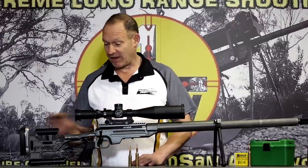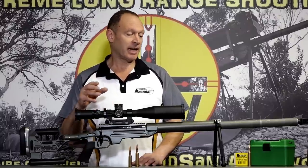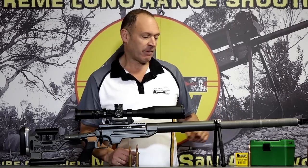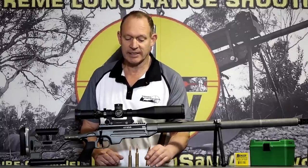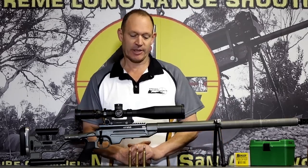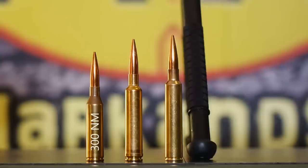But the concept, everything worked really well, worked really nicely. But the whole time I designed this, with this front tube, everything was engineered to be able to fit the structured barrel in it. So it's a step up with a structured barrel. That's what it's shooting now. Once again, a little poor bolt face, but that is the 33XC cartridge. So it's basically a souped up 338 Lapua cartridge designed by David Tubb. And at this moment, performing very well in this structured barrel.